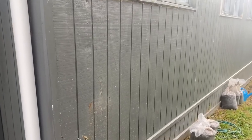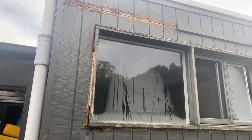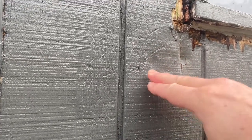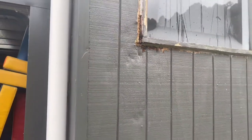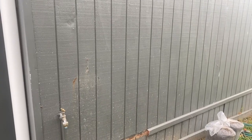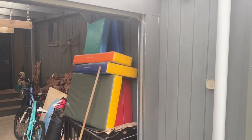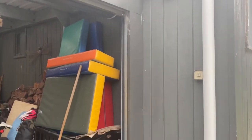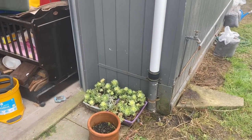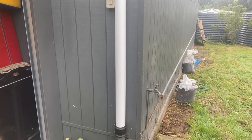This is the corner of that room from the outside. You can see I started pulling off some of the quad around the windows — it looks very wet, and this is the problem we've had. This sheet is just really waterlogged, so whatever's happened underneath is keeping the moisture in that wall. I need to take that off today and replace it, something I have never done before. One thing I did fix already is this pipe here — when we first moved in it was leaking from the connection and was very moldy and wet in this corner.